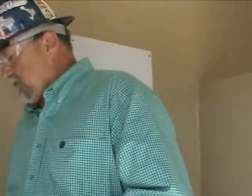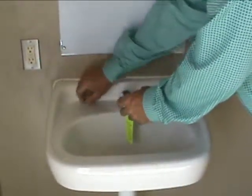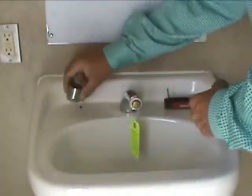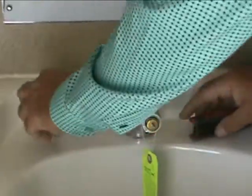Should your building not have been flushed properly at start, or if you have problems with water quality, we're going to show you a few things you can do to help clean out your fixtures to keep them working properly. This particular fixture here — if you have a Zurn faucet, you want to remove the temperature indicator. A 3/64 Allen wrench will take that off.